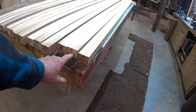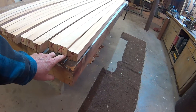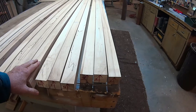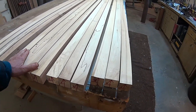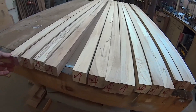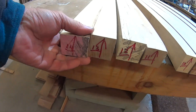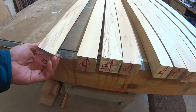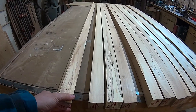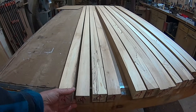These are about two inches thick yet — the finished countertop I'm shooting for is about one and a half inches thick, possibly a little thinner. There's still some scrap on here. I think I'm going to run them through the table saw to get them a little more consistent in thickness, as some got a little thin. Some of these boards were really warped from just air drying and sitting down here in the basement for the summer.